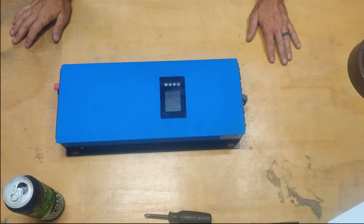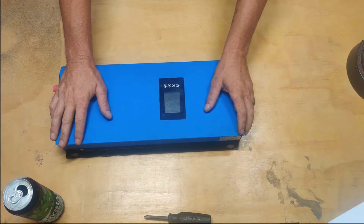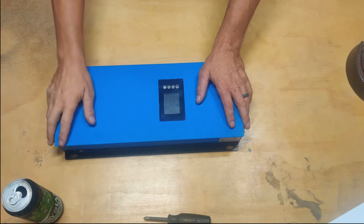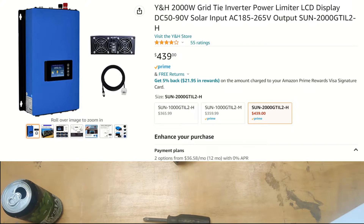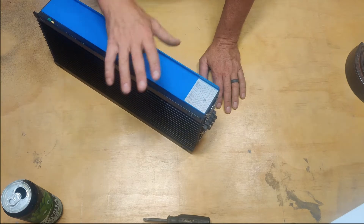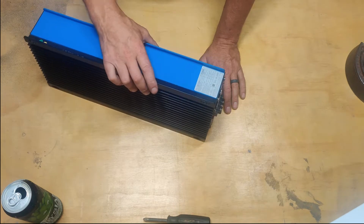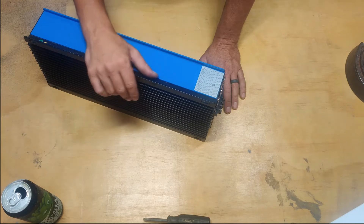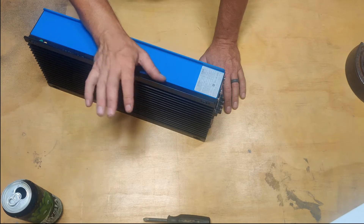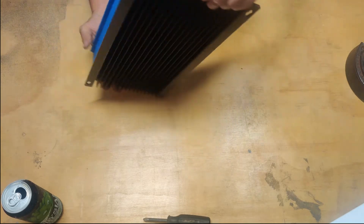This has been a video long time coming. I had a world of fun with this little 2000 watt solar hybrid inverter — the Sun 2000 G2. This is a 2000 watt, 230/240 volt split phase inverter, 40 to 65 Hz, with a DC input range of 45 to 90 volts — and that's going to become important later. I bought this for testing.